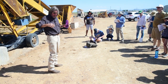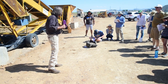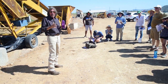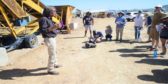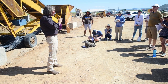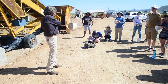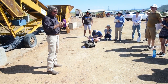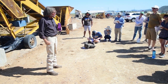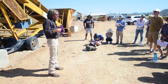But when you put them together in a nice, moist earth block, you need to let them dance in a cool or at least dark, moist place. For 28 days, they'll marry, they'll never divorce. If you take them out early, you could have marital problems. They didn't finish. They didn't get together. The chemical reaction was not complete between the clay and the lime. So the lime takes a little longer.